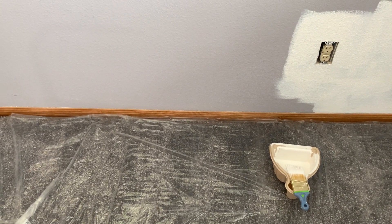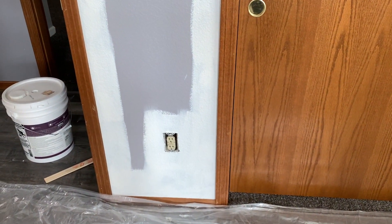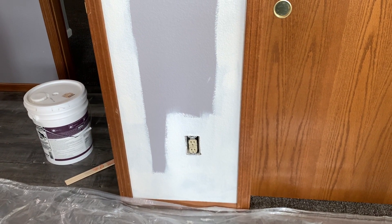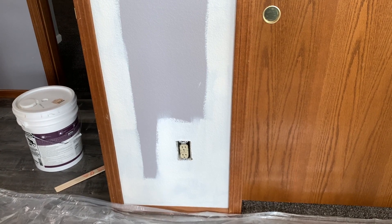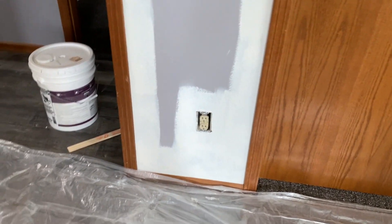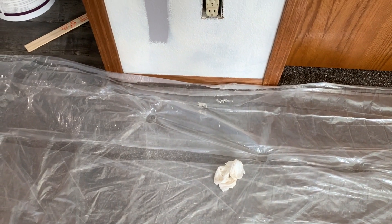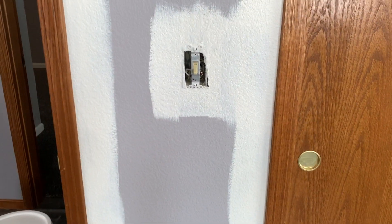I have not taped off the trim. I know some of you that may be a question — why haven't you taped off the trim? And my answer is that normally when I have taped off trim in the past, it doesn't work out too well for me, because it always seems to seep underneath the tape for some reason. It always seeps under the tape and gets on the trim anyways. So I feel like it's just easier and saves time if I just paint really carefully so as not to get anything on the trim. That works out good for me. If there's paint on the trim that was already there, I'm going to try to get that off. I always just keep a little rag or small piece of paper towel, a little bit damp, so that I can wipe anything off right away if I do happen to get something on the trim.